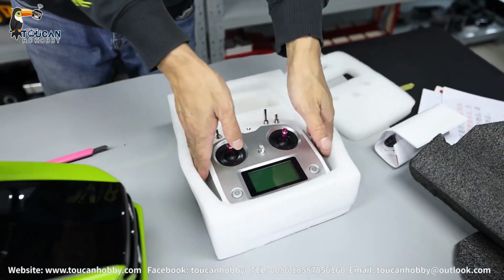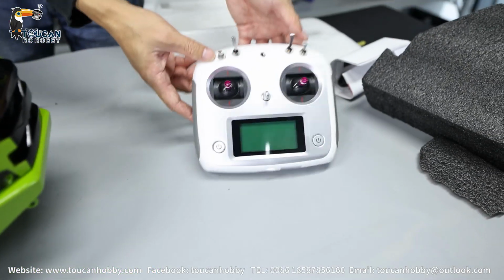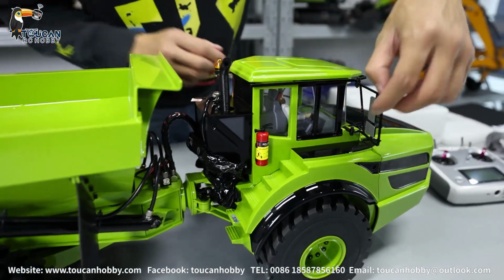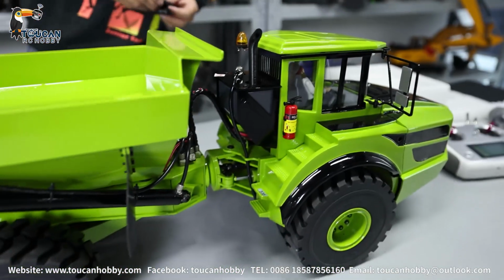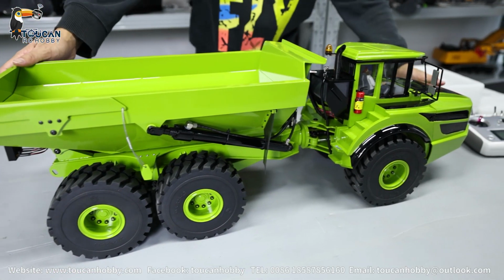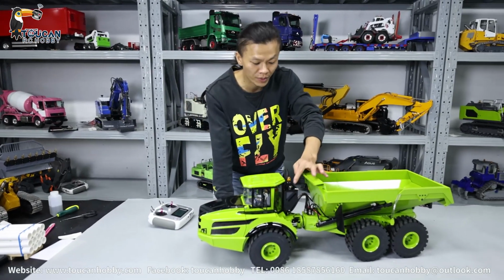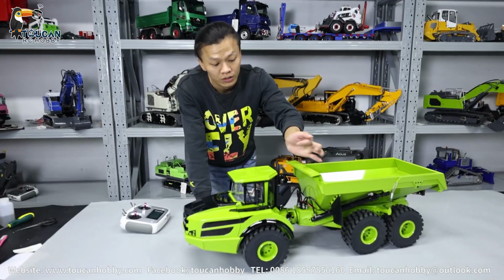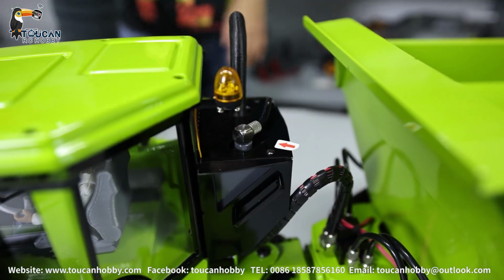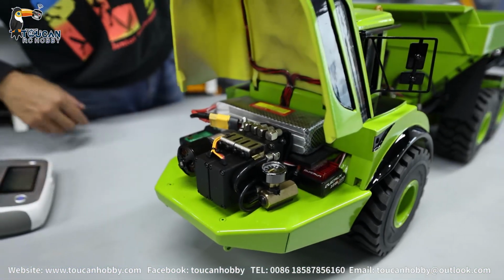Menu. Okay. So looks like the mirror, everything is already on. So we only need to put the battery and fill up hydraulic oil, then we will be able to operate it. We already put hydraulic oil from here. Here is the oil tank. This return line, take it out and can fill up the oil here. Okay, and the battery from the front engine cover is already connected.